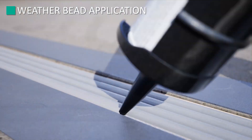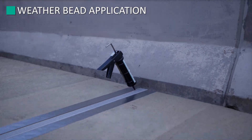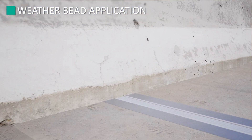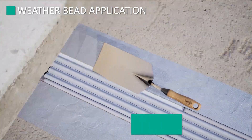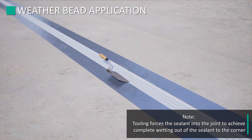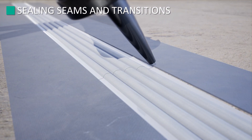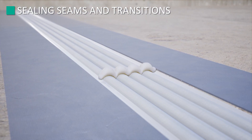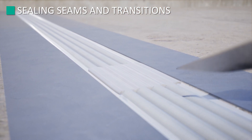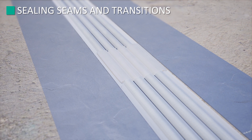Run a quarter-inch bead of the supplied silicone along both sides of the joint where the foam stick meets the joint wall. This will assist in creating a weather-tight seal. Tool each bead to form a smooth, concave cant bead on each side of the joint. Run a small bead of the supplied silicone splice sealant over and just under the surface of the cured sealant in all butt joint seams and transitions. Tool all butt joints and transitions, ensuring the sealant has adequately wetted out the surface of the sticks and filled any voids in the splice — this also creates a clean, aesthetic finish.